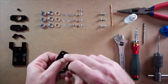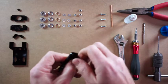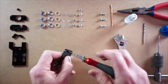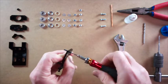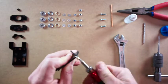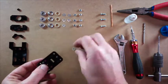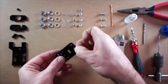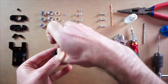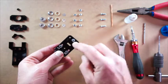Now this hole here is quite a tight fit. You might have to screw that in. It doesn't really want to push through. It's not threaded, but yeah, it will. And you can actually ease it up by giving it a couple of turns once it's screwed in. Once we've done that, you can flip this over and we'll just put 3 washers on. 1, 2, 3. These give clearance for the bearings, just so that the outer face of the bearing doesn't scrape on the plastic.